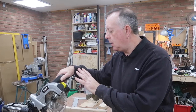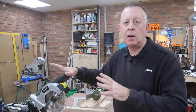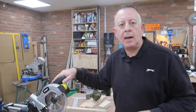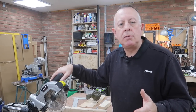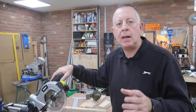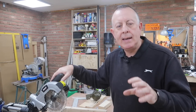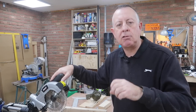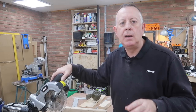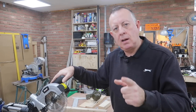The perpendicular cut to the fence — if you get that correct, the preset angles of 15, 22.5, 30, and 45 degrees should naturally follow and be correct. These are built into the machine while it's being cast, and I've never had a problem with those as long as you've got the initial cut perpendicular and correct to the fence. I'm really happy that this is now square in both directions — anything I cut on a project is going to be nice and square. I hope you've enjoyed this video; please check out the other ones on my channel and our Patreon page. Until next week, I'll see you then.